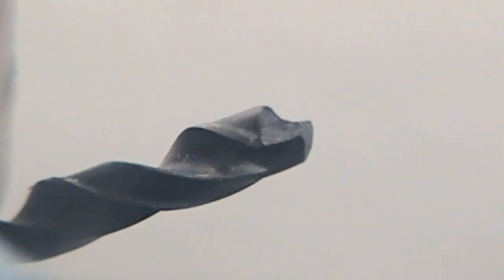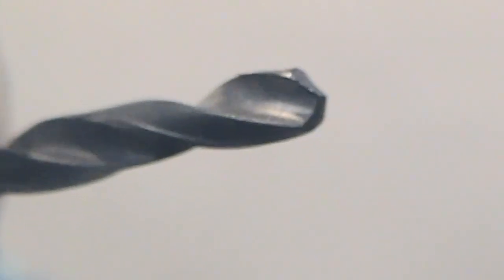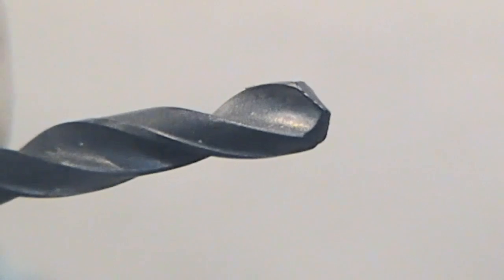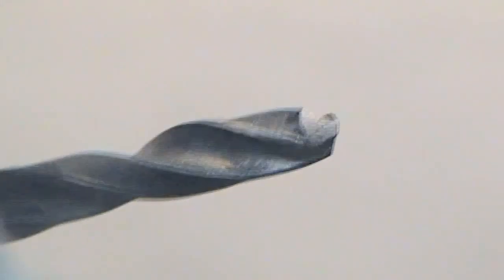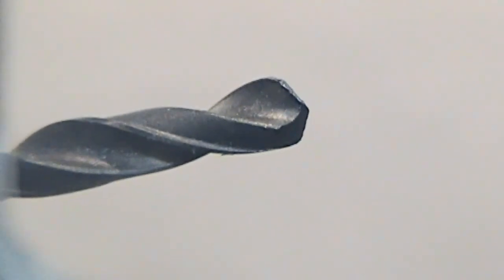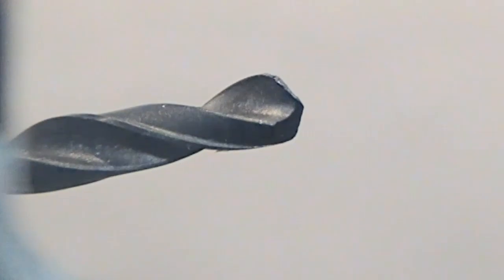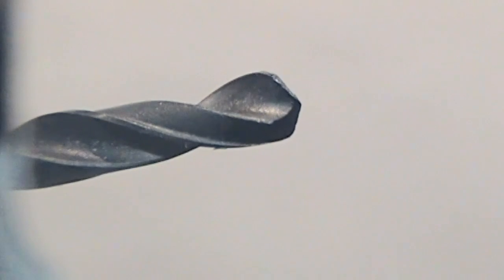So this may work — I've got Sharpie on there, I'm using the 3/16", so if I go much smaller it'll be hard to see. We've got Sharpie on both faces. You might just about see — if I can get focused there — that edge looks a little bit torn, a slight reflection. Same on that one. I'm just going to dress those a little bit and see if we can get a change.